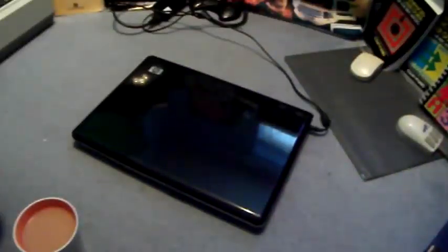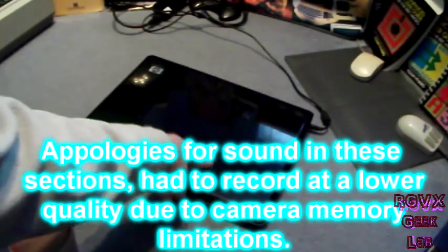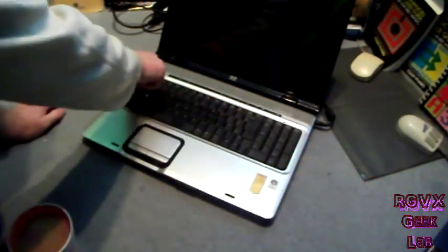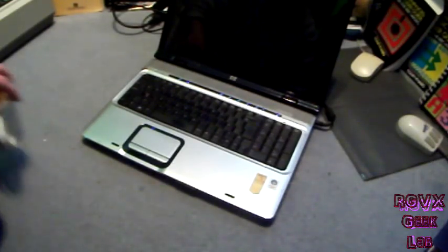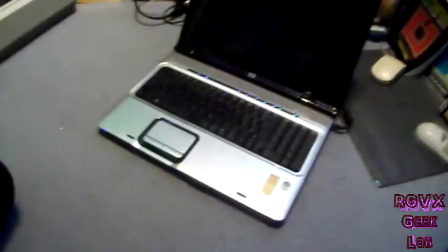Okay, and welcome to the lab with our patient — and our cup of tea. Now, first of all, how do we know that it's the video card that's gone and not the motherboard completely? Well, if we take the power light on, you will all know from your own computers that as you're booting up there's a certain sequence of lights the hard drive goes through, and from this light here I can see that my hard drive is doing its usual thing. So that means the motherboard is actually fine, and the video card is playing up.